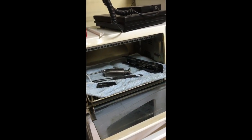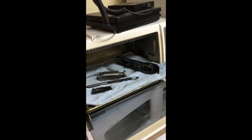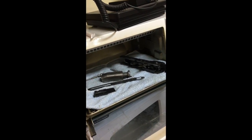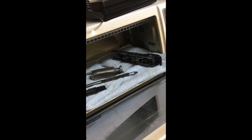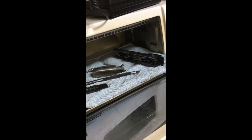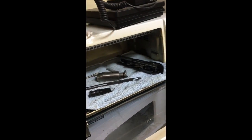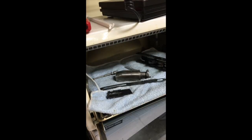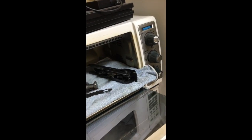Next step — they've been rinsed out, they've been shaken out. Yes, ladies and gentlemen, this is a toaster oven. If you remember your high school chemistry classes, water boils at 212 degrees. So we set this handy-dandy toaster oven at 200 degrees, put the parts in the toaster oven, and cook them for about 20 minutes. Whenever we take them out, all of the water is gone. They are bone dry — there is no moisture, no lubrication in them whatsoever. Don't use paper; use some cloth. Be very careful it doesn't touch your elements or you will burn your gun parts and your toaster oven down. Probably not OSHA approved, but it's highly effective.